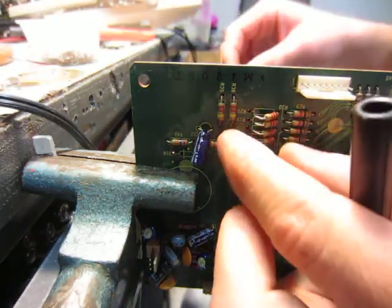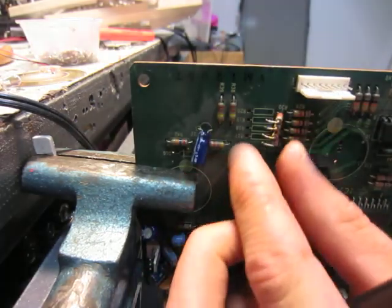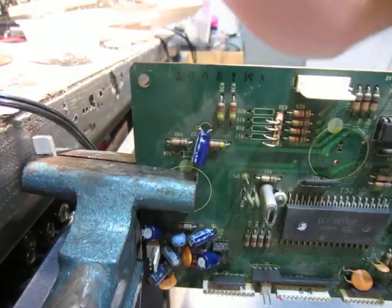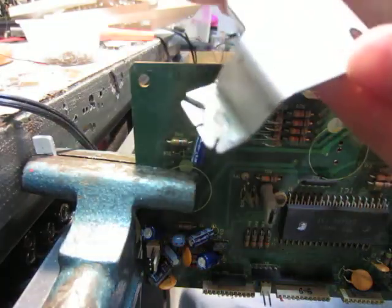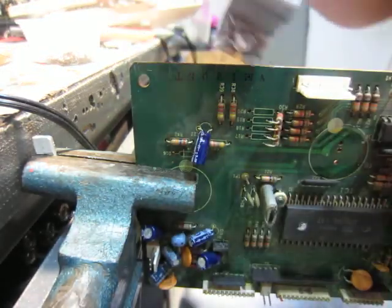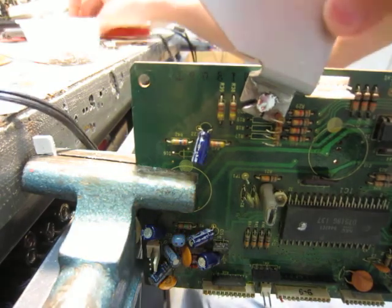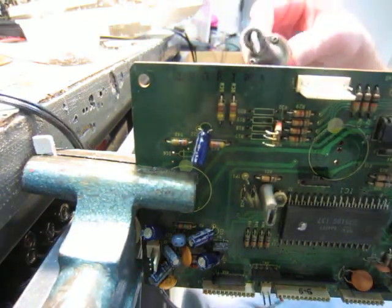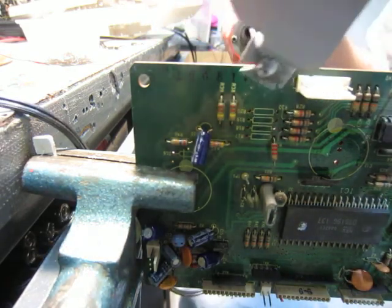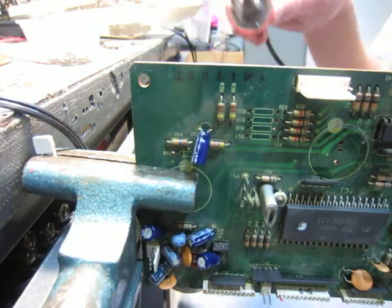So now you could just grab this with your fingers and then unsolder, but your fingers are probably still gonna get burnt. Or you could grab with pliers, but they usually crush them. So I made up this little tool — it's just a random piece of metal, I cut some slots in it. You just insert this around the component, then heat it up on the back and it pops out. I always have a box underneath and they fall into the box. That's how I get the components off.